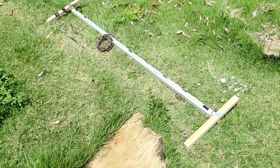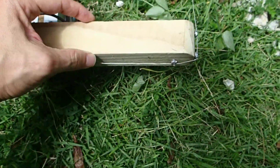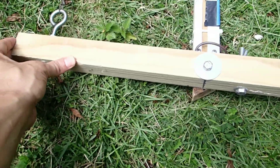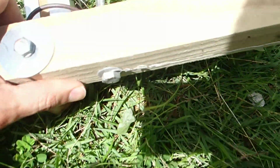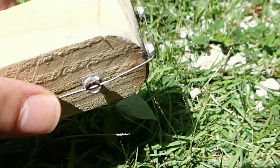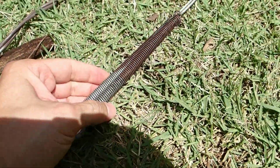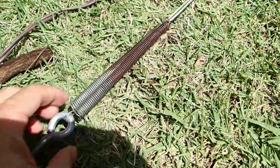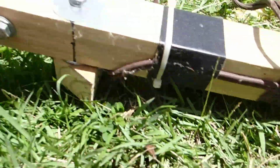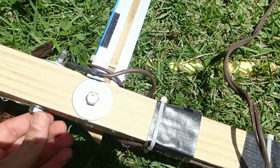The first thing that we need is a foam cutter. We use this to cut the foam in the shape that we want for our blade. This is built with 1.5 by 1.5 inch dowels and reinforced with aluminum L-shaped spars. Here you can see the wire attached, which is a specific wire that heats with current. This wire goes from one side to the other, and on the other side it is tensioned with a cable and springs so the cutting wire is tight. I use these springs and this adjuster so I can adjust the tension of the springs and the cable. These are the electrical connections to the wire, which go from one side to the other so the wire is heated and cuts the foam when it goes through it.